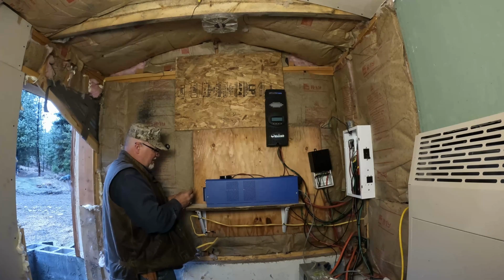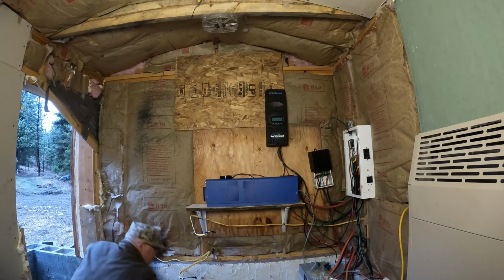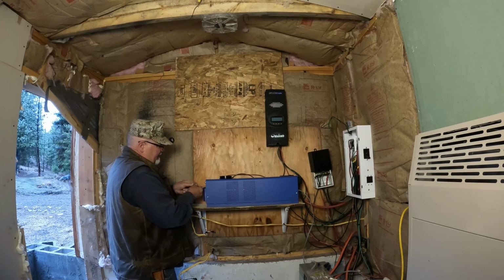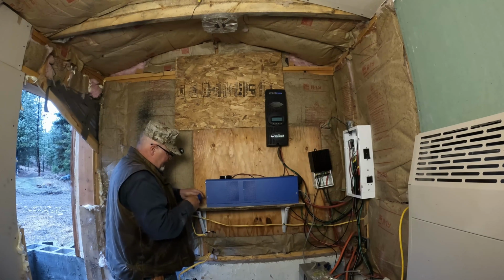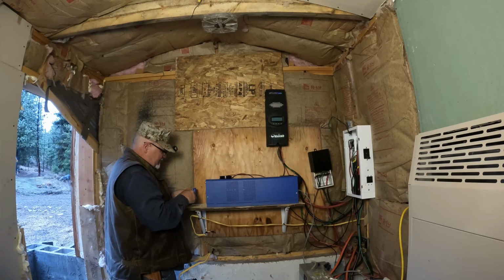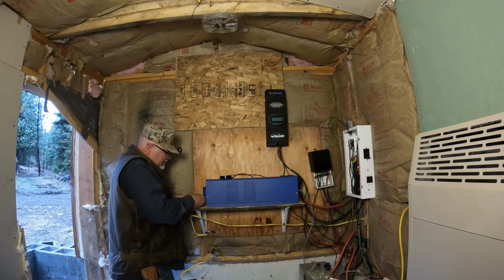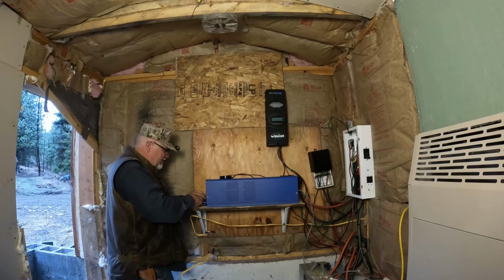Well, obviously in here, with LiFePO4 batteries with battery monitoring systems, it's not as much of an issue. However, if you're running AGMs or lead batteries, they don't have that feature, so you're not going to see what your power is on those guys. So having a battery readout right on the inverter, folks, that's actually, in my opinion, pretty amazing.